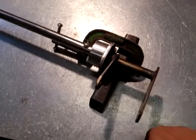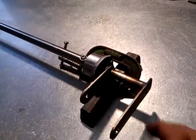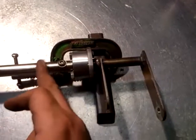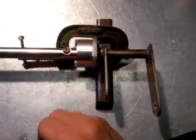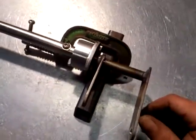So looking at the construction then, you know me by now, most of it's either going to be stainless steel or aluminium. So essentially these levers are stainless steel made of 3mm plate. As you can see, they're shaped and drilled on the ends to accept the connections to the various cables. This here is a single piece of stainless bar. It's actually around this long, so it's pushed into the tube about this far. So it's machined to the right sizes to fit the various bits. Okay. This here is a 6mm thick steel bracket. I'm afraid you can't see it too well, but that's what's ultimately going to be welded into the chassis to hold the whole thing. Okay.